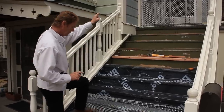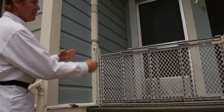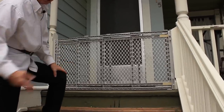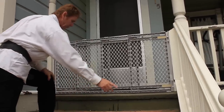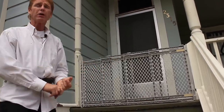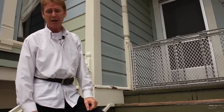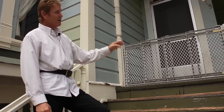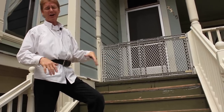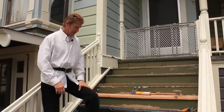What we did on the top deck about eight years ago for my buddy — the deck leaked like a sieve. He said, 'Kirk, I got people living downstairs, can you fix it?' We put the same product on it: wire, two coats of cement, and then an acrylic finish. He asked, 'What's the difference between putting an acrylic finish on it versus tile?' I said, 'Drop an egg on this and try to clean it the next day. Drop a glass of wine on it.' Acrylic finishes are made for walls, not surfaces like this. But since he's my buddy and I have leftover acrylics from other jobs, we're going to do it for him until he decides to actually place some tile on it.